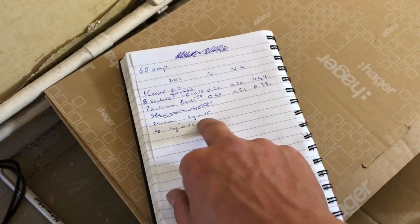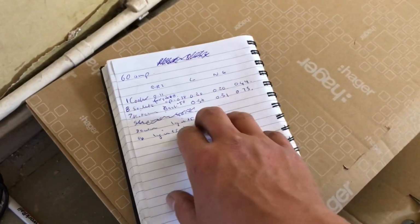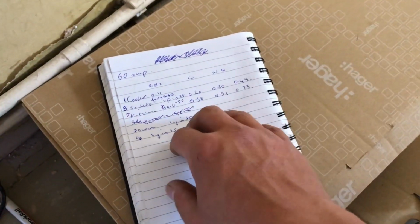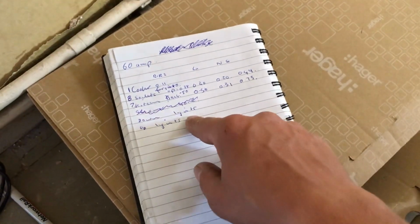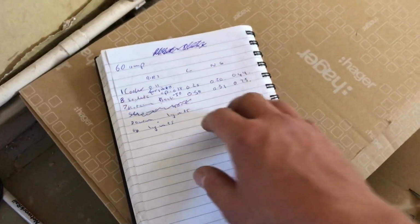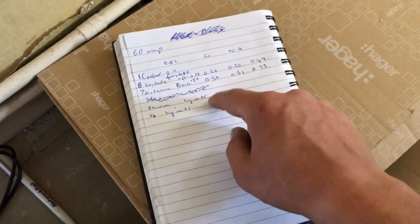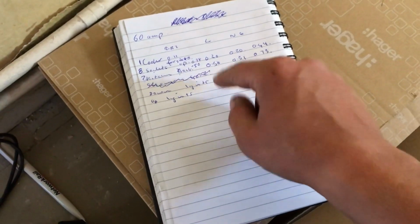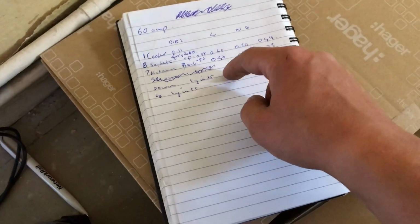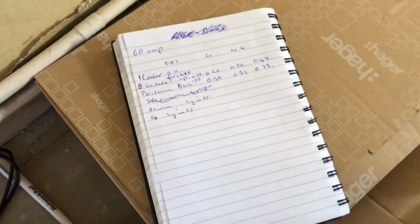So now all I've got to do is do some R1R2 readings on the downlights. Then I can actually go around and plug in all the loads, lamps, accessories, etc. Sockets are all clear now because I've done that. So it's literally just take some light bulbs out and do some insulation resistance testing. And just remember to go between the neutrals on the separate lighting circuits, just because you don't want any cross neutrals like I had on my last job. So I don't want any of that here, even though this would be really easy to sort out because there's hardly any ceilings up, to be fair.